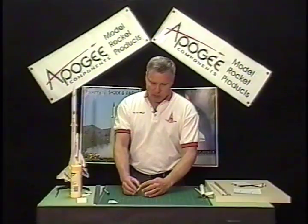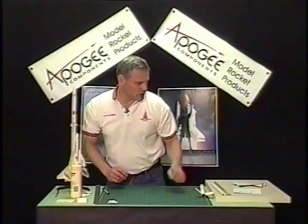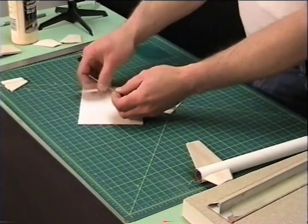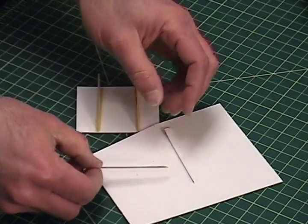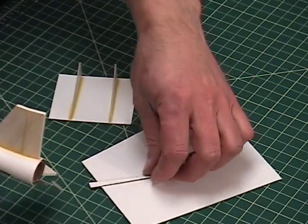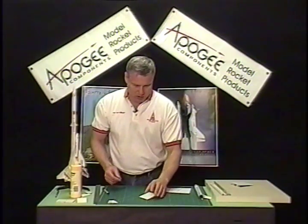The way we're going to do this is we're going to bevel the inside edge of the pieces of wood so that when we bring them together it's a very tight joint. Our main tool is going to be a little table wedge like this. These are really easy to make — I just made this out of cardboard. I cut two strips of cardboard and the angle is actually pretty critical: that angle is half of the angle of the joint. So on this particular rocket I made a ten degree bend, so these are going to be five degrees. I'll just glue those to the cardboard like this and it creates a little table. Pretty easy so far.